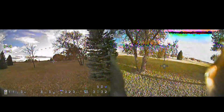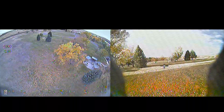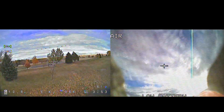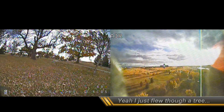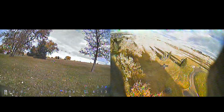I also tried out stabilize mode and horizon mode. This part of the video shows a difference: on the left-hand side we have the RunCam Swift Micro with a TBS Unify Pro and a cloverleaf antenna, and on the right we have the HGLRC TX20 with just a dipole antenna and the HGLRC ELF camera. You can see the performance on the cameras is pretty much the same — I'm thinking they're both RunCams. A little bit later in the day, about a half hour later, I'm getting significantly more breakup on the Unify Pro side than on the TX20.